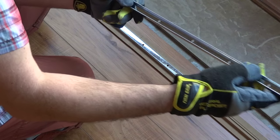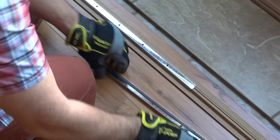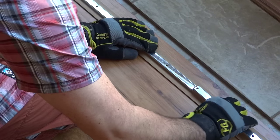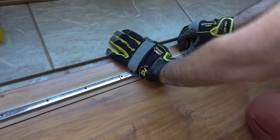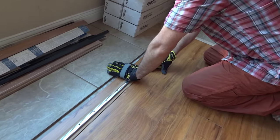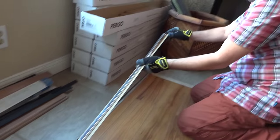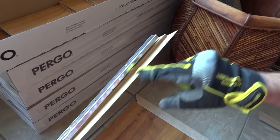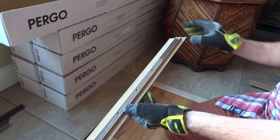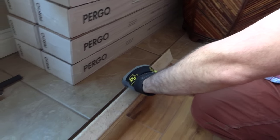So we've got the second track piece cut here. The joint is right about here for the T-mount joint — it meets there. And then we're just going to track off the remaining amount of this second T-mount, and basically that's just going to snap into place. Just continuing to snap this metal, pushing the track into place, right up to the corner. So if you notice, I left a little bit of space on the corner — actually on both corners — and that gives me a little bit of adjustment, tiny adjustments when it comes to the glue down.